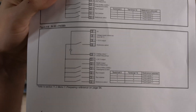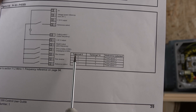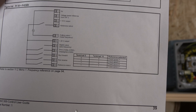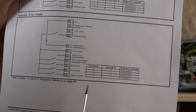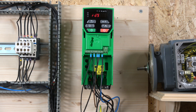Here's the logic for the preset selections using terminals 5 and 14: if both are at zero on startup, you get preset speed 1. If terminal 14 is closed and terminal 5 is open, you get preset speed 2. If terminal 5 is closed and terminal 14 is open, you get preset speed 3. If both terminals are closed, you get preset speed 4. It's essentially ones and zeros changing the logic inside the drive.